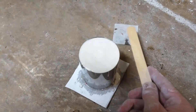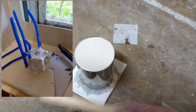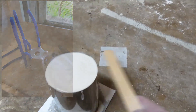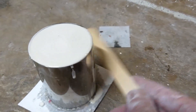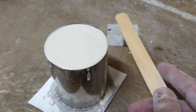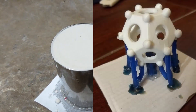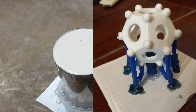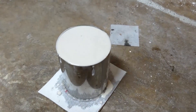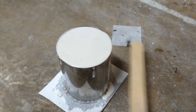You've just seen a few pictures of the dodecahedron that I've 3D printed and put the sprues on. I just finished pouring the investment and what I'm doing is tapping it lightly so all the bubbles come out, because I don't have a vacuum machine.